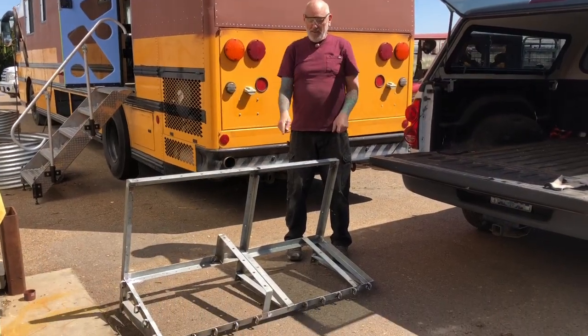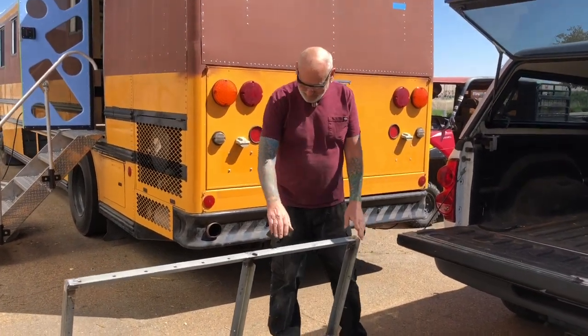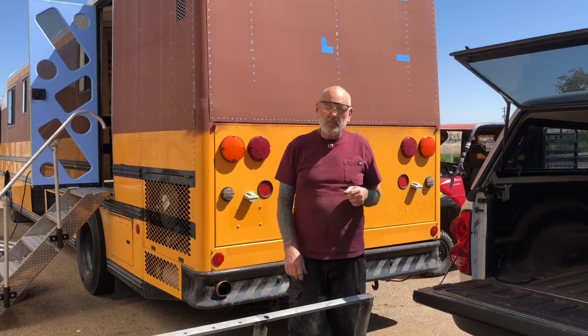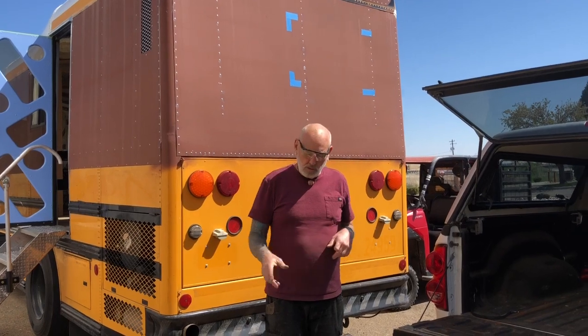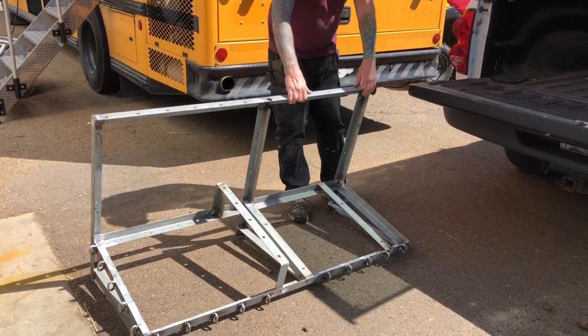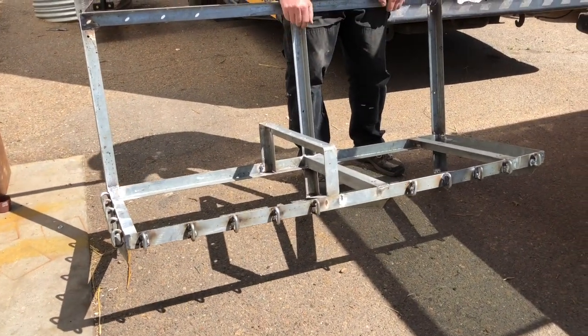What's up YouTube? My rack is not — but it's ready to go up on there. I thought we could scrub it off with wire brushes and paint it ourselves, but when I was painting some of my flashings for the ceiling I found it's hard to paint galvanized without serious etching prep. So I'm going to take it to the powder coater, let him sandblast it and clean it up good, then powder coat it. We got little hangers on there, and the mini split goes here — all drilled and ready to mount.